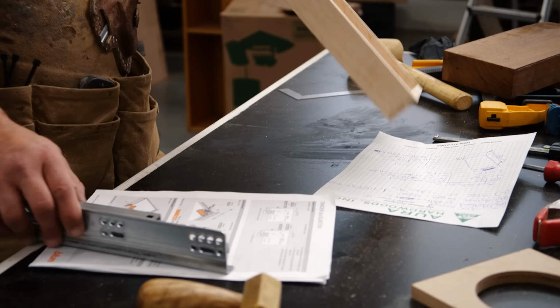Well, it came out great. And I butchered that a little bit. I think I could have come up with a better way to remove the material for these notches, but it came out really good. One thing I didn't mention is that it's a 6mm or roughly 7/32nd drill bit, and you drill that 10 millimeters deep for the holes that hold the back of the slides. So we're gonna go ahead and put this in.